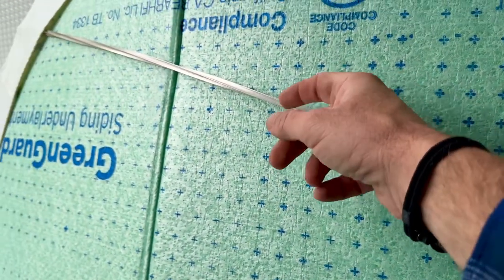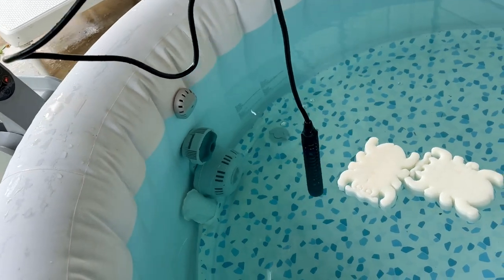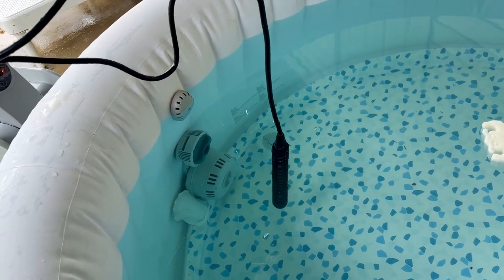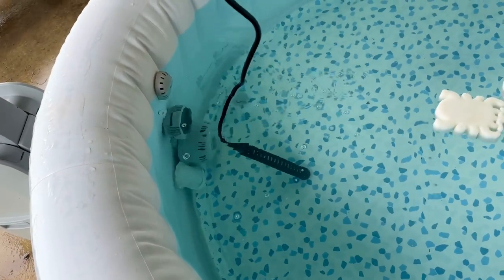The idea for this bar is to hang the immersion heater off of it. In theory the immersion heater is safe enough to just lay on the bottom of the tub without damaging the plastic, but I'm a little uncomfortable with that — this thing gets awfully hot. So I want to hang mine vertically right in front of the outlet, so that water coming out of the pump and heater has to blow across the immersion heater and keep the water circulating. I'm just worried about it getting too hot and damaging the tub if it just sits on the bottom.